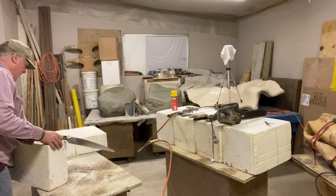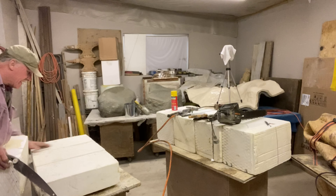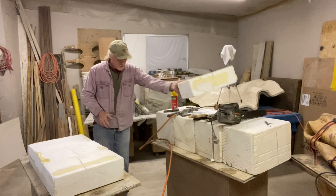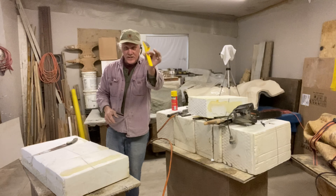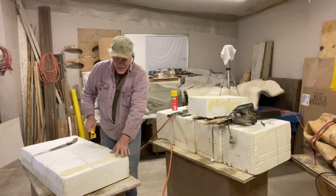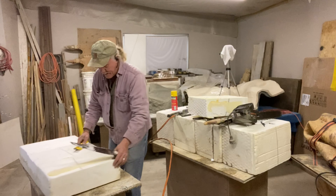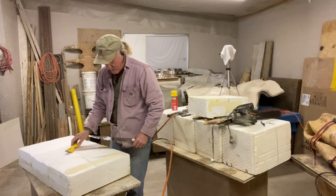I got all that cut, going to start out with this as a base. That's sitting nice and flat on the bottom — you don't want it to rock. This is an auto body tool; for fine detailing they make a variety of these, they're like a file. Right now I'm just trying to clean this up where it's flat when I look down it, so I can bond another piece easily to it. This is a previous glue area here, so it's sticking up, and I don't want it to.